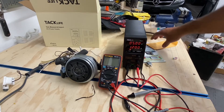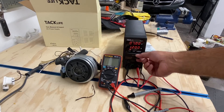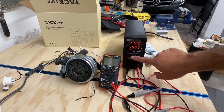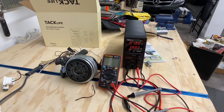One of the features I really like is the output button. It allows you to set your voltage and your max current, make sure you've got it where you want, and then click the output button. I think that's a very valuable feature to have on these things, so if you're going to buy one, really consider that option.